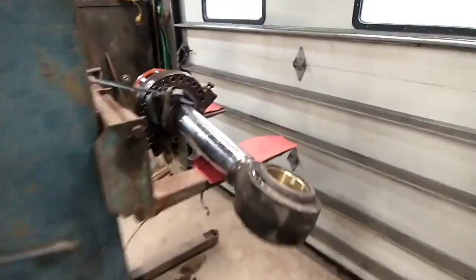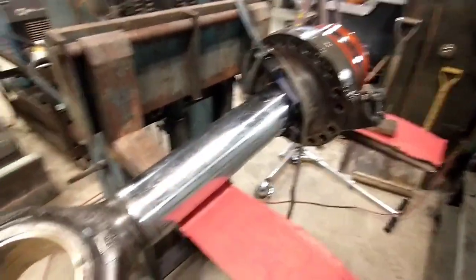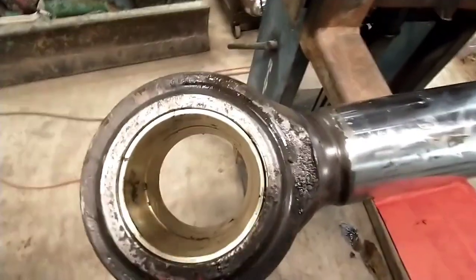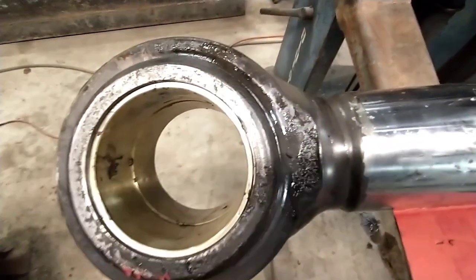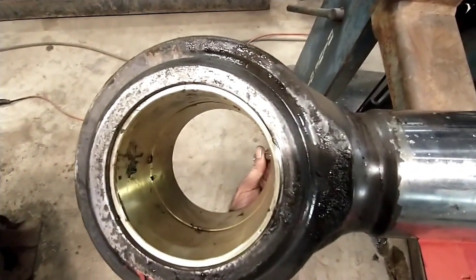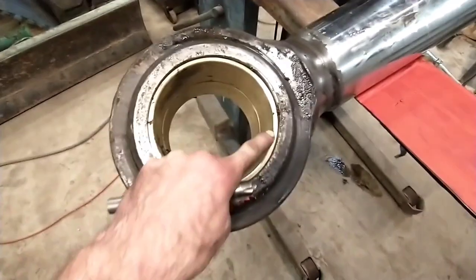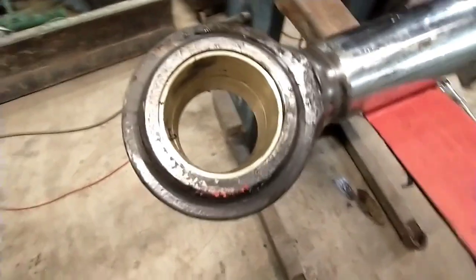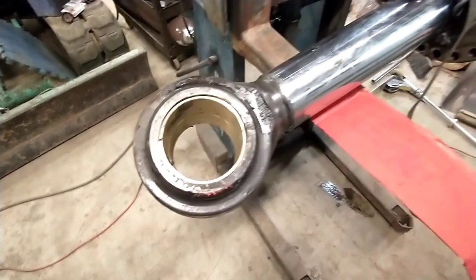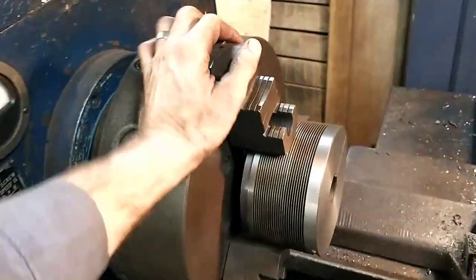This is the project that just rolled in - as you can see, this is not a baby. I think this is off a Volvo loader; it might be the tilt cylinder. They pressed a new bushing in and you can see the daylight shining through behind it - it's not making contact. It's lumped out, so they want me to press the new bushing back out and then get this thing welded.